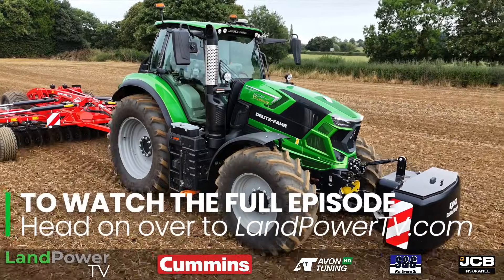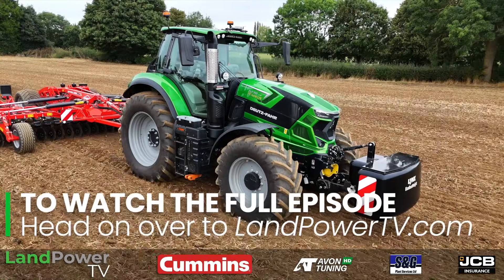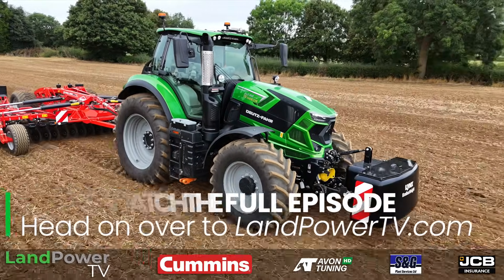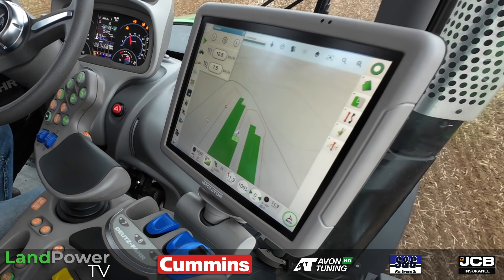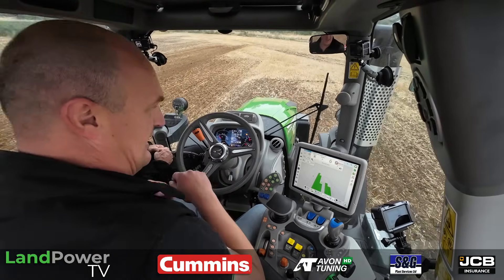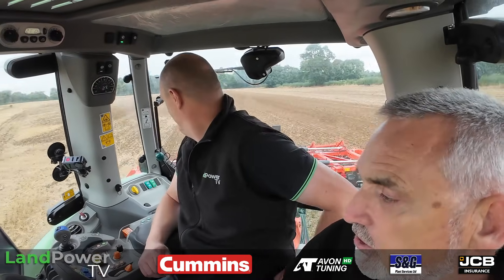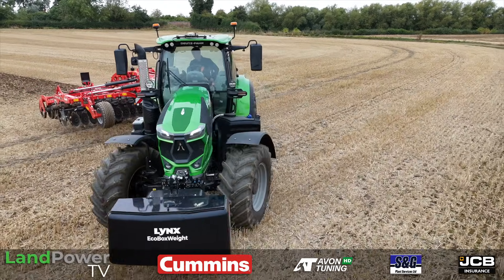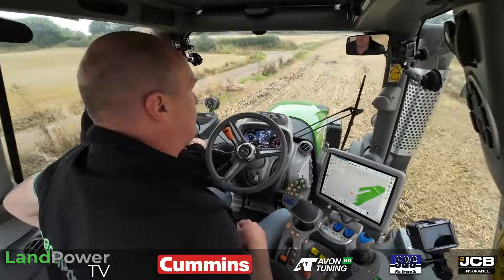Because we actually unfairly started in the middle of the field, it might just have a hiccup on this next one. But we have options to override any headland turn it's suggesting to us. We might say we want to take a left turn this time instead of a right turn. We're sort of approaching the headland on a big angle, and it's worked out the radius it needs to turn. Because what we've put in there is the potential radius for the tractor, and we said how close to the edge of the field we want it to get. So it knows its limits and works its way through.